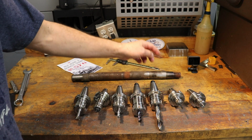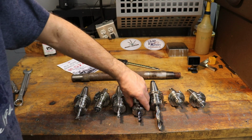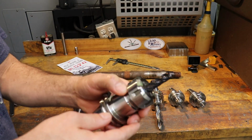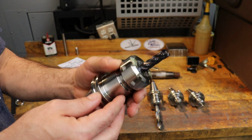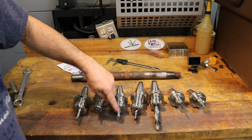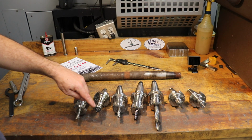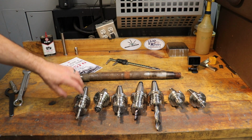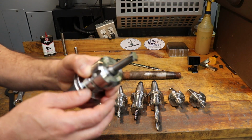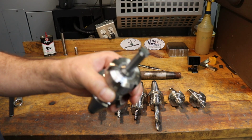half inch end mills. 3/4 inch drill to drill out the center of the nut. Roughing end mill with the knurled teeth on there. These will chip away at the material, and it's a real efficient cutting scheme. And then our finishing end mill is just a smooth flute, three flute. And then a quarter inch four flute end mill for cutting the castle notches. And then here is the threading end mill that we already looked at a little bit. So, all right, let's load these up. I'm going to set the tool heights and the zero location for the first nut machine.